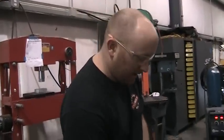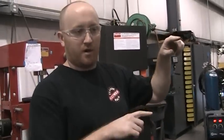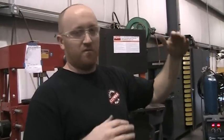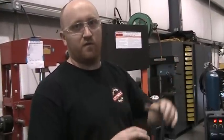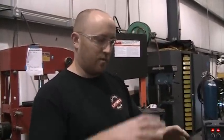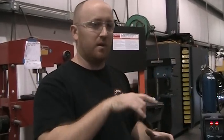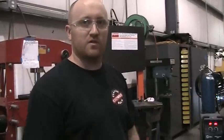We also have the improvement to the door frame, where we've added structure into the door frame. Before it was basically just a top bar and a bottom bar with nothing in between, and we've maintained those two bars and then just added some structure in the center point of it in the form of some 1/16 inch thick steel with, again, some holes in it to lighten it up, also to be able to access the track bolts. So the frame itself will also be a lot more rigid.